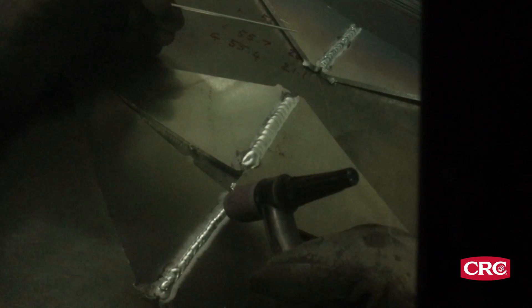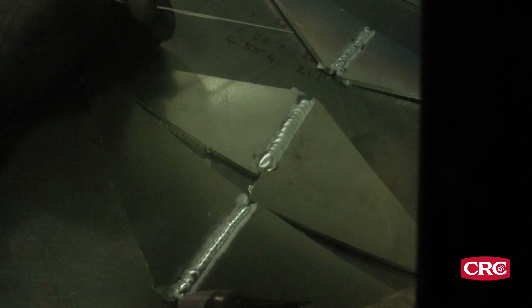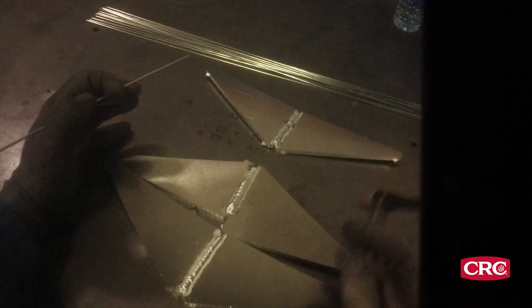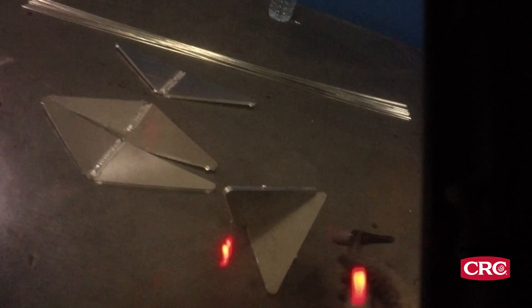You can really see the cold one versus the hot one — how wide the hot one was and how narrow the cold one was. When it looks gray, you got too hot. When it looks really narrow and almost too narrow, you got just a little bit too cold. I'm going to do one more — the 90-degree T-joint, which is usually what they call the hardest one to do.